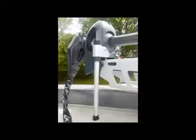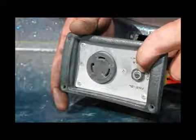I also installed the Minn Kota support arm, which is a must for keeping the motor locked down secure in rough water. The shaft comes longer than you need, so you have to cut it down to fit exactly the distance needed in your boat.